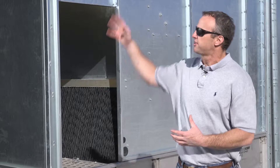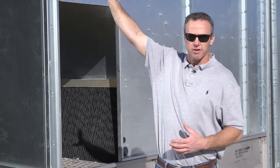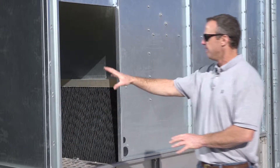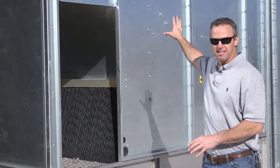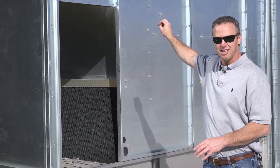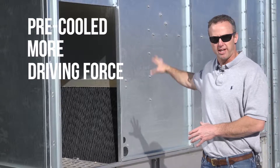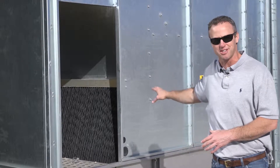The way it works when you combine these two is you start with your circulating water at the top of the tower, bring it down through your cross flow fill using evaporative cooling to cool that water. At that point it enters an intermediate basin at the top of the bottom section, and now this water is pre-cooled so we have more driving force to pull heat through heat transfer off of the coils in the bottom section.